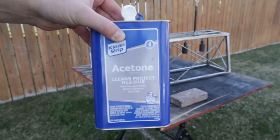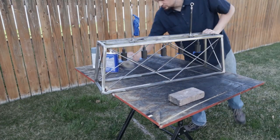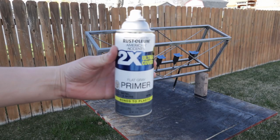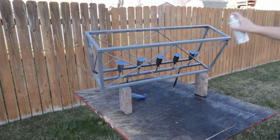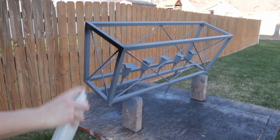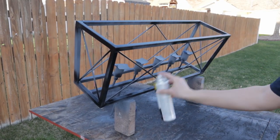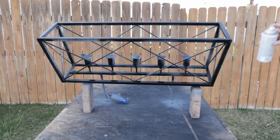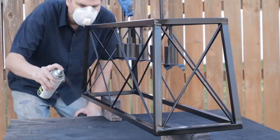But as you'll see right here in about two seconds, I do wipe it all down with acetone. You can use any type of degreaser or solvent. What you're doing is getting into all the creases, cracks, all the places that have some of the oily substance left over from the mill or from your steel supply shop — yes, they put that kind of stuff on there so it doesn't corrode. Please take my advice: clean the metal prior to paint, because there is really nothing worse than finishing a beautiful project and then having the paint chip away or fall off after a couple weeks.